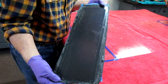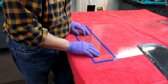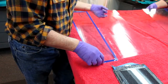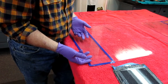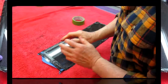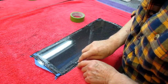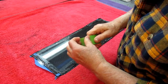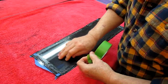One of the nice things is the side against the glass is nice and smooth and shiny. I'm going to leave this on here because we may want to make another piece of similar size — no point taking it off. The PVA I'd only trust once. So we've now shown the saran wrap method to release a part and the PVA method, even though we used up 20-year-old PVA. When you get the part off in one piece, the edges are razor blades — anywhere the resin picked up the carbon there are millions of little porcupine needles, so I've got to be careful.